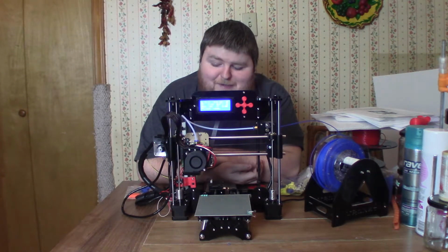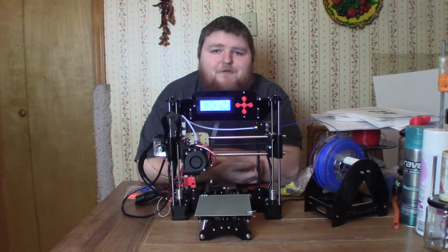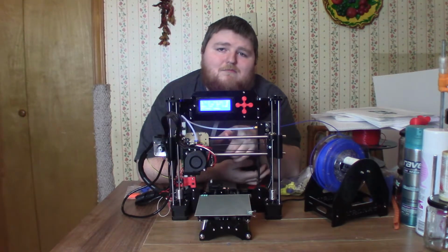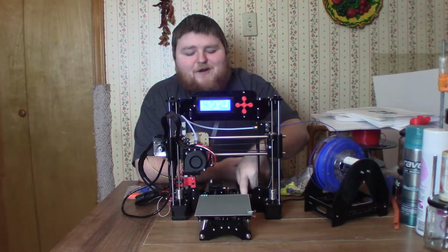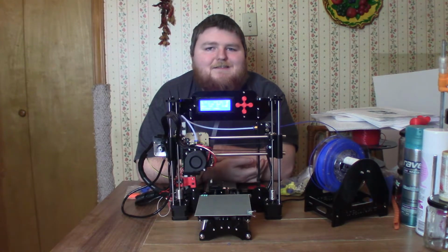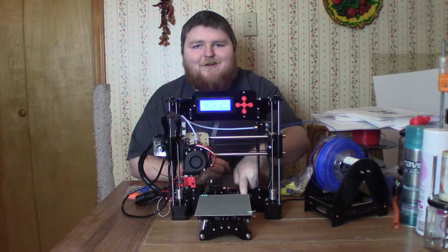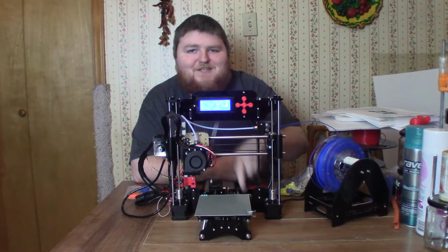One last thing, and this is mainly to the iMaker team. Don't stick all your rods together. Please don't do that. I don't know what rods you're using. How do I know that these are really hard material, like chrome? I don't. And you're sticking these with these and with the threaded rod down here on the Y. They just stick them all together bundled. Don't do that, guys. Come on. Coming in from shipping, it gets bumps and bangs, and then you have threaded rod rubbing against a different thread down here. You have this lead screw pitch being affected by this threaded rod pitch and vice versa.